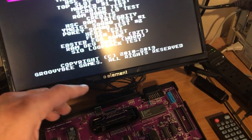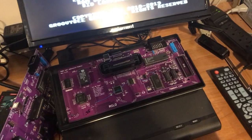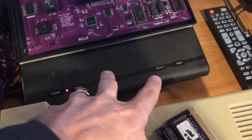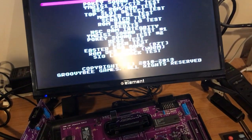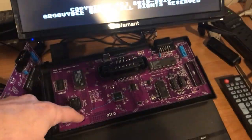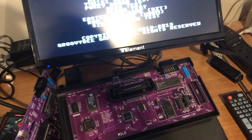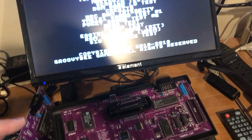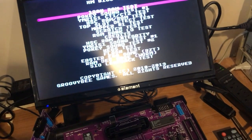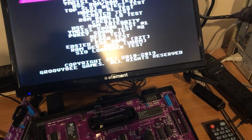And that's the maintenance mode that I showed you in yesterday's demo, where at any high score screen on any game, you press the pause and then press the select button together. And that brings up the high score maintenance page. I would like to actually add that directly into the BIOS and do a jump statement and go directly to that particular section of the memory address in the BIOS and run that high score maintenance routine. This way, it may be a little bit easier for everybody than trying to catch it like I tried a couple of times, and it's not easy to do. So I'm going to look at that and try that out.